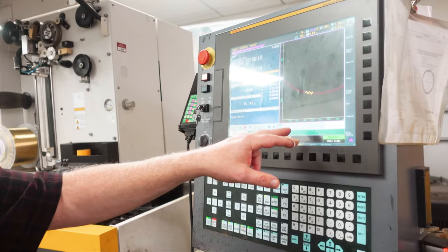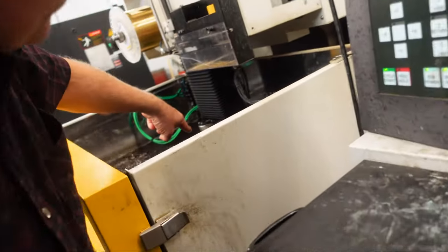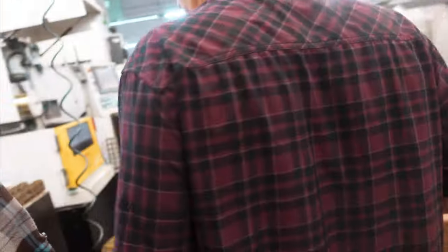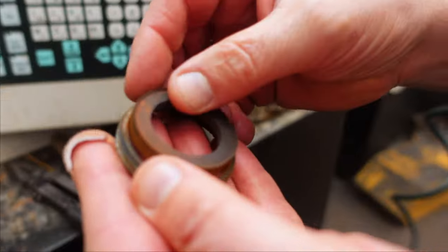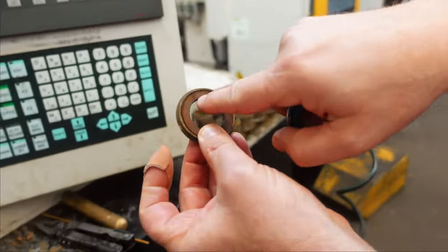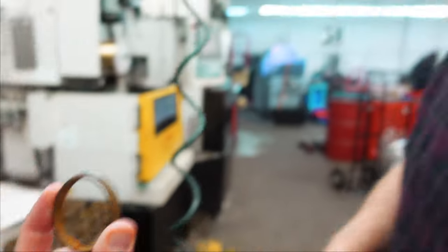In about another 30 minutes we'll see that one finished and take it out of the machine. See that little blue spark going on in there? That's what's basically doing the cutting. You can see right here a finished ring to get a better sense of what's going on. It starts out as a solid ring, then you can see the little wire path that dances around — when it's done, the center piece is thrown away and you have a ring with teeth in it.